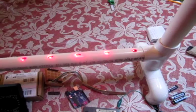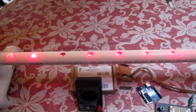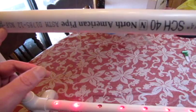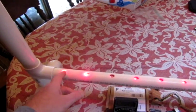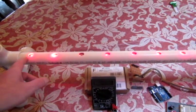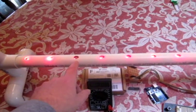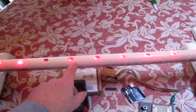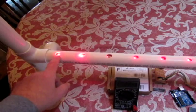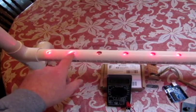You'll be able to see that those are all glowing, so the lasers are firing from up top down to the bottom. That was pretty much the toughest part — I was trying to get that all lined up. Because if you're off a millimeter, that translates to about a quarter inch by the time it gets down here. Things aren't exactly lined up; I had to play around with the positioning of the photoresistors. They're not all perfectly aligned — I had to make the holes a little bit bigger than intended so I could move the photoresistors within the hole.